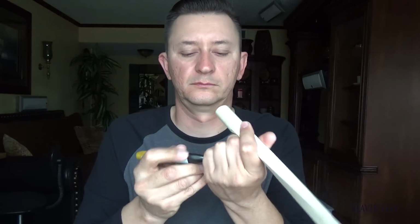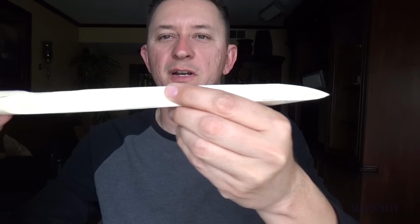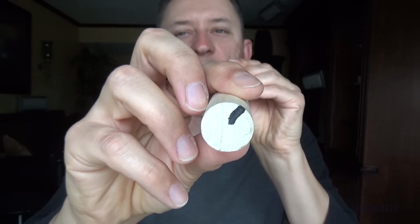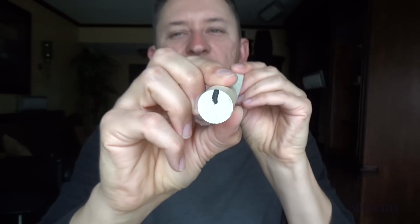If you're looking at it, you could see the mark, right? As I'm twisting, as you grind, you could see that it's twisting, right? So as I'm grinding, you see how the line is moving? That's the bevel. The bevel's twisting. When you get to the tip, look which way it goes, the opposite. See it?